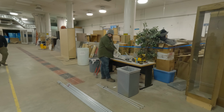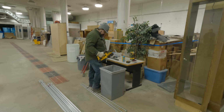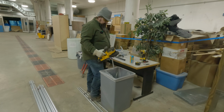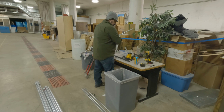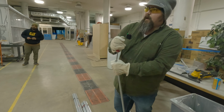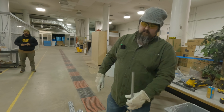On all of these, after you're cutting, I don't have a reamer here because I couldn't find it. But you're going to be reaming your pipe to get the burrs and stuff off, right? A lot of times if you don't actually have one, I wouldn't use a screwdriver, but I've used a set of diagonal pliers, your channel locks, all that good stuff. You're trying to get all those sharp edges off.